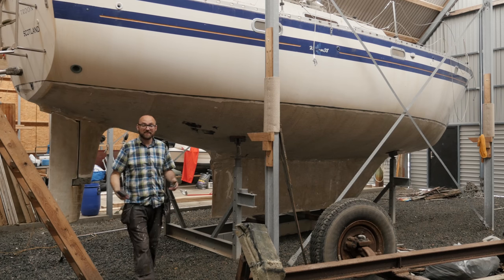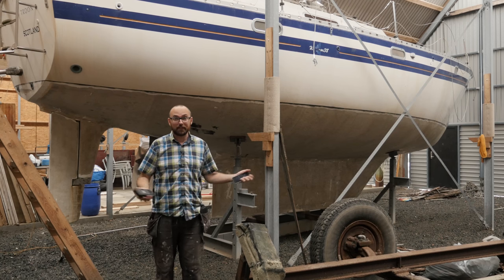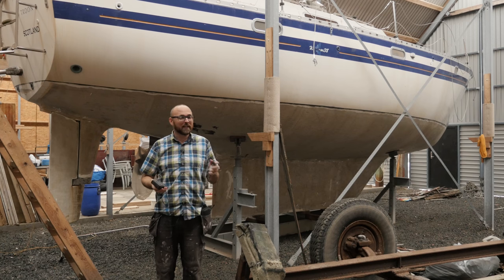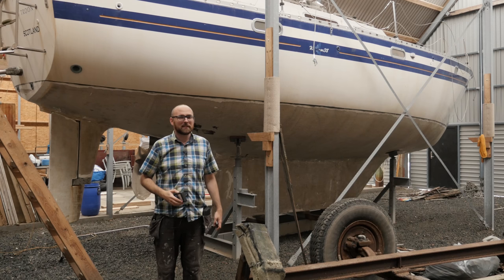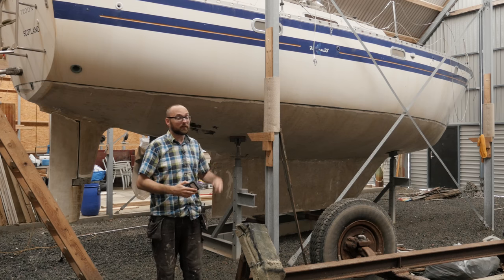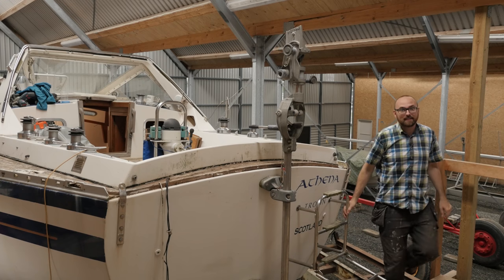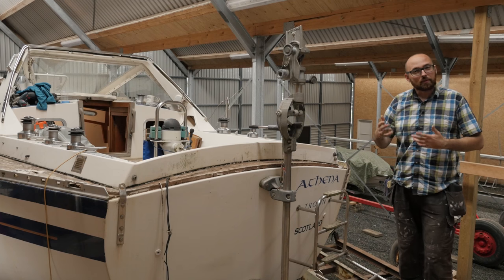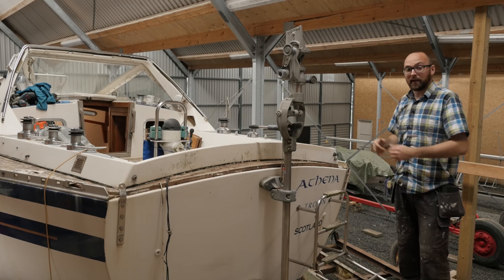Yeah. There's absolutely no measurable difference in the moisture readings after Athena spent 1 week here in the shed. But that's okay. I'm putting all of my trust in that homemade hot wax type system I mentioned a few weeks back. But it is proving to be a little bit of a challenge to get my hands on the silicone heater mats I'll use to heat up the hull while it's under vacuum. With a little bit of luck, I should be able to order the silicone heater mats I need next week. After that, there's about a 2 to 3 week lead time, but that's okay. That should still leave me plenty of time to get the hull dried out.